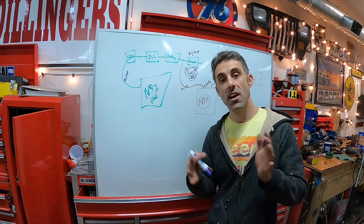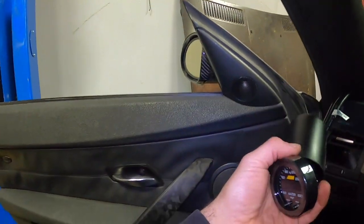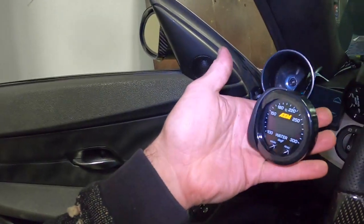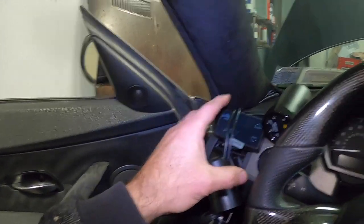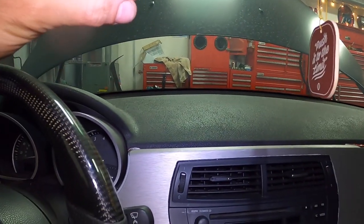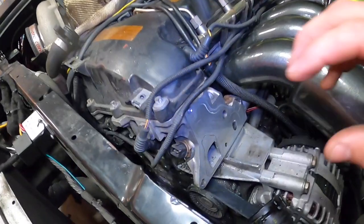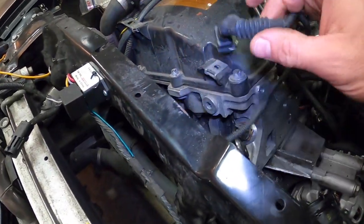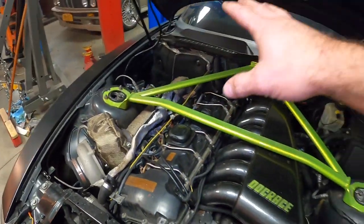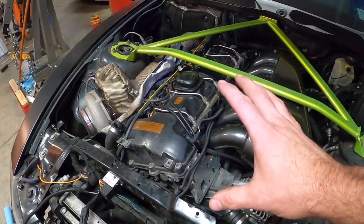What we need is another solution for providing engine temperature data to the driver — an aftermarket sensor. The customer had included an aftermarket cooling temperature sensor with a gauge, and while the routing looks a bit haphazard, that's something we can fix. This requires us to tap an actual temperature sensor onto the block or nearby location. On the N54, the engine temperature sensor is right here — it's a two-pin sensor, and both pins go directly into the DME and report engine temperature.